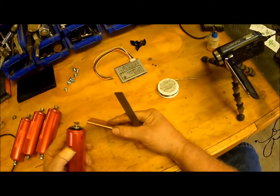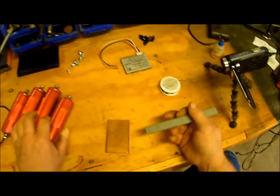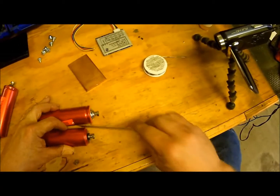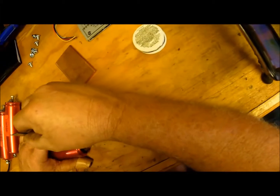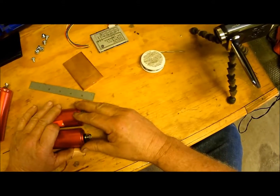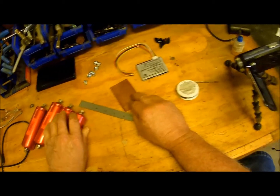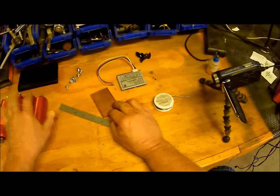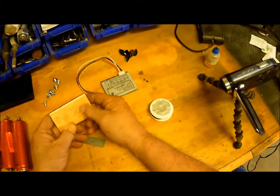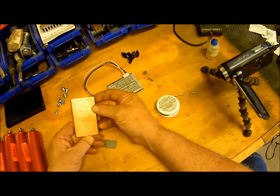Anyway, we're going to hollow these out so it sits in there and recesses and won't move. I've got one piece of this and we're going to segment it in three lines, cut it to the length we need, because I want a little bit of spacing between them — something right around there. I want the battery pack to be compact, but you don't want them touching one another if you can avoid it, because the outer body of the cell is ground all the time. Another reason I'm going with copper instead of the little thin nickel strips you can get for these is I want something a little hardier, and not only that, I want something I can solder to pretty easily. That's some thick copper, I know, but I could still probably get it soldered on there pretty decently. So anyway, let's get to it.